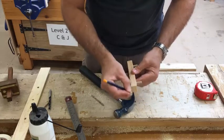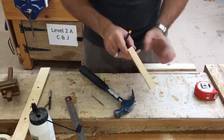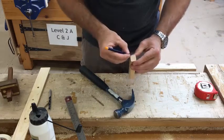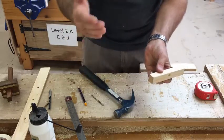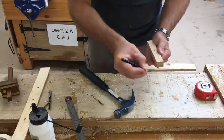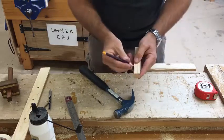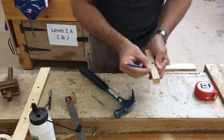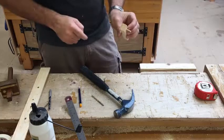Please practice this skill. It is fantastic. Especially out on site, you just need a quick parallel line to the edge, especially if it's just a rough cut. See all the way around, and see how we're just nice and accurate back. It is very accurate, guys. So what I'm going to do is I'm just going to come in again, a couple of mil. And what we're going to do is we're just going to clean the edge off.